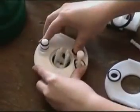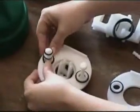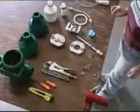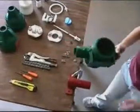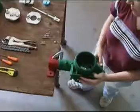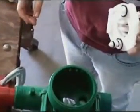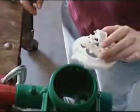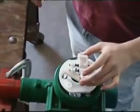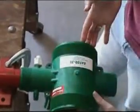Place the motor main body outlet with the pressure hose fitting into the assembly fixture. Turn the body so that the top side is up. The top side is the side with the grooves running down inside the large diameter bore. Drop the intake exhaust valve module into the body. Be sure that the exhaust valve is towards the outlet of the body. Do not seat the valves into the body at this time.